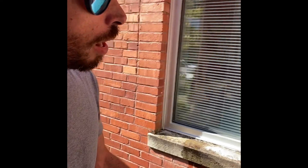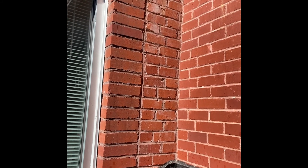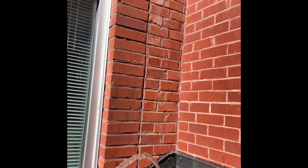I'm just going to spray this wall right here. I'm going to start — I'm thinking that it's actually the brick. So I'm going to start to rule out the roof. I'm just going to spray this counter flashing and this sidewall flashing. We've got a little apron detail right there. I think that's all sealed up pretty good, but I'm just going to spray.